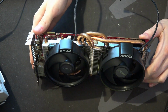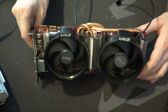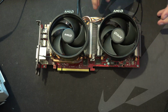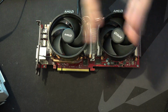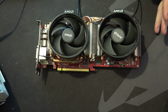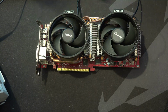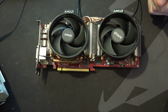So still, temperatures were fine, except I was really just running Fire Strike. And the card, since it is based loosely on the HD 7950 PCB, is one of those cards that has an OCP because this card doesn't ship with any real VRM cooling. Normally you basically just get this heatsink and a shroud and that was it. It's one of those super down-costed 7970s. Now, there are 7970s with even further down-costed PCBs. You can go as low as getting a 7970 with a 4-phase VRM and completely disabled voltage control, because you know what would happen if that wasn't disabled.